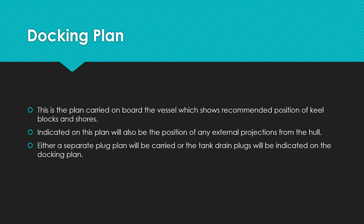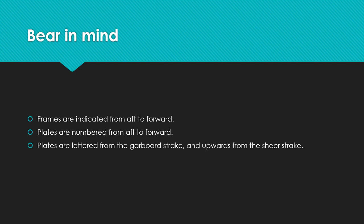You may carry out maintenance and remove those plugs, but make sure you put them back before the vessel sails out — otherwise the vessel will be taking in water when it comes out of the dry dock and goes back into the sea.